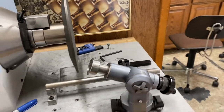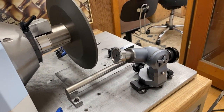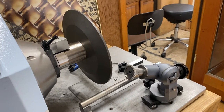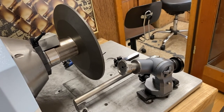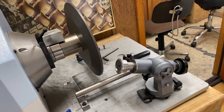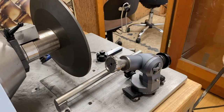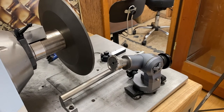And like I said, you only get one or two shots at it before you start peeling away steel off of that bezel. So I'm glad I did enough checking to make sure I got the angle correct. And I've done one preliminary check with a lapping machine on, getting a good strike all the way around. And the coverage of the refinishing is looking great.